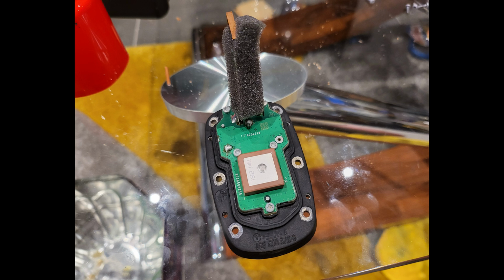I'm certain that the reflow that I put on there is adequate to last me a bunch of years to come. Certainly more years than I'm probably going to keep the car. So yeah, good to go. It took me probably, I suppose now I know what I'm doing, I could do the whole thing in less than an hour probably. Reflow and all, less than an hour and no money. As long as you've got a solder iron and some solder, then you're good to go.